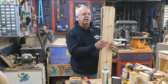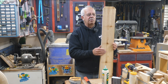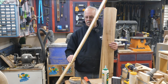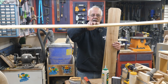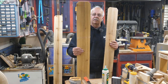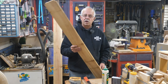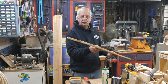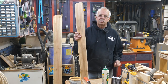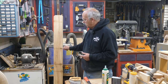This is made out of a cedar fence picket. You can get these at your home store — I picked these up at Menards. A couple things to watch when picking one out: try to find one that's not bowed. This one has a bow to it, so try to avoid that. Try to avoid anything with a split in it, like this one has at the top. Try not to get one that's cupped too badly. These are cheap — $3.69 — so you'll need one, unless you make a mistake, in which case you might need two.